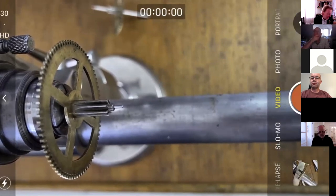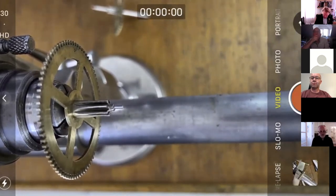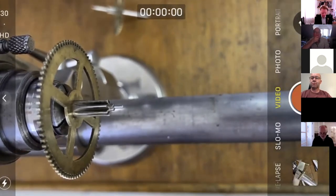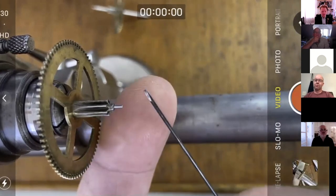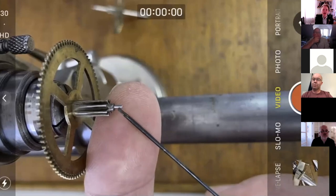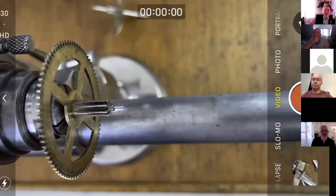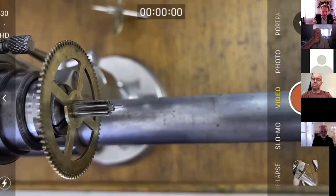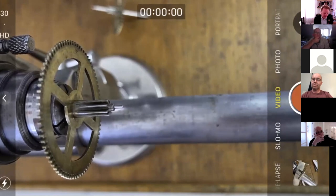So this week, I made another drill, which is here. I'll just offer it up to the... Is it here? Oh, yes, there. So I made another drill. But this time I was slightly more sensible and I made it out of 1 millimeter stock. And I don't know why I didn't do this the first time, because there's plenty of meat here on this arbor. It's not that we're short of material. Sometimes the arbor diameter isn't a whole lot more than the pivot diameter. So you've got to really keep it neat.